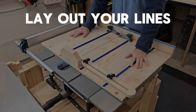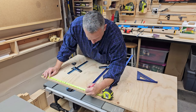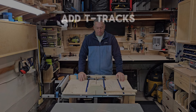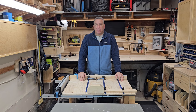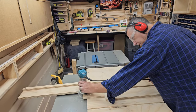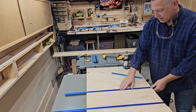Now using the base, you want to lay out lines for your kerf, the miter slots, and any t-tracks that you want to have inside the base. After you've laid out your lines, cut out your t-tracks. You could use the table saw with a dado stack, which would probably be easier, but I ended up using the router instead. Using a scrap piece of wood and double-sided tape, I got my groove, and then using a three-quarter inch bit, I made my channel for the t-tracks.